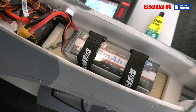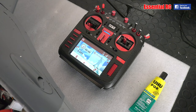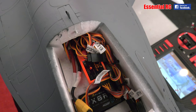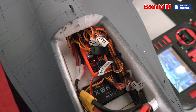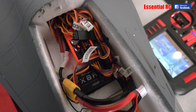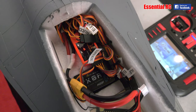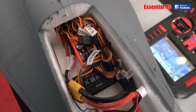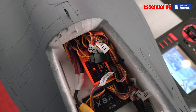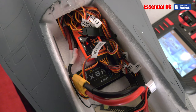But so you can see here, I've got my Frsky X8R, programmed it up on my TX16S from RadioMaster. The Reflex version 2 system has an S-bus lead out of it, so that's what I have used to plug into the X8R S-bus plug for the primary control surfaces. And then I just need to plug in one other lead, and that was for the landing gear, which does not go through the reflex box. You just put that straight into the X8R, so only two leads.